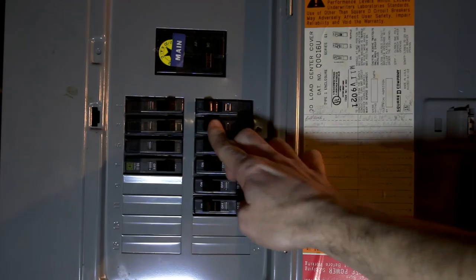Let's go turn the breaker back on and see how this thing works. And just like that, we're done — it was a pretty easy installation. With this particular light there's a little initial setup time: once you turn the power back on, you have to let the light calibrate for about a minute or so, maybe a little longer. The instructions say within that time the light may flicker on and off, but let it do its thing and you'll be in good shape in no time.